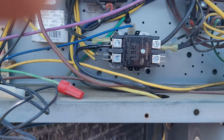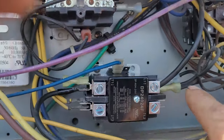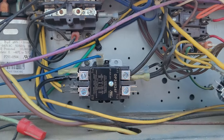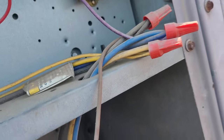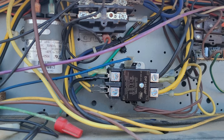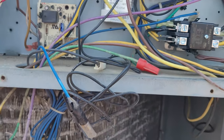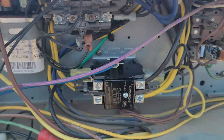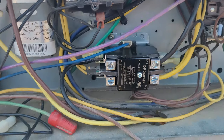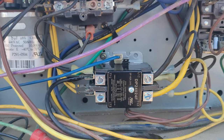Many times they're color-coded — yellow stays with the same side as yellow, black the same. They're not always color-coded. Then the last one will be my low voltage common to the bottom here, and it's in. We'll apply power and give it a minute to reset — and it's back on. That's the easy, quick way to change out a bad 24-volt contactor.